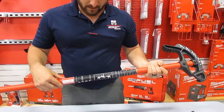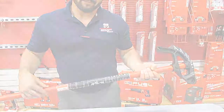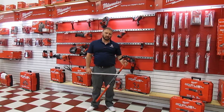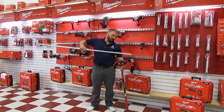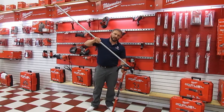Hopefully your apprentices memorize this table before it wears off the handle. And now, Milwaukee Hand Bender in action. This is a three-quarter-inch EMT steelhead bender — we're just going to bend a little three-inch offset on 30-degree bends.